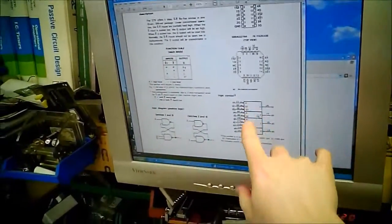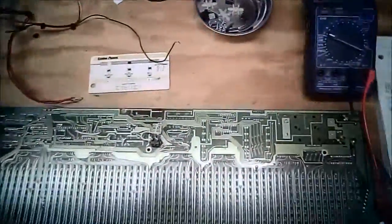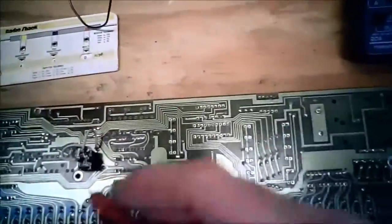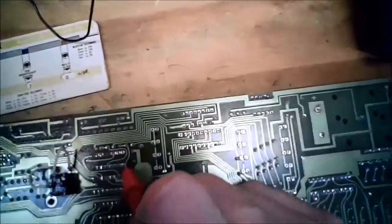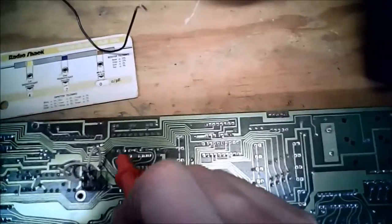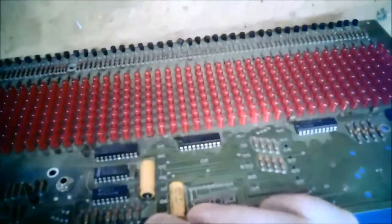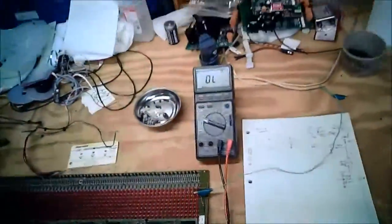So a bunch of these pins are going to have to go back somewhere. And looking at this, that somewhere is the chip right above it, which is a 138 3 to 8 decoder. Now, the real question is, is there anything else? There's one more flip-flop right there, which I don't see wired to anything, but there could be wires underneath that are hooked up and it goes and drives something else on the card that may be important.